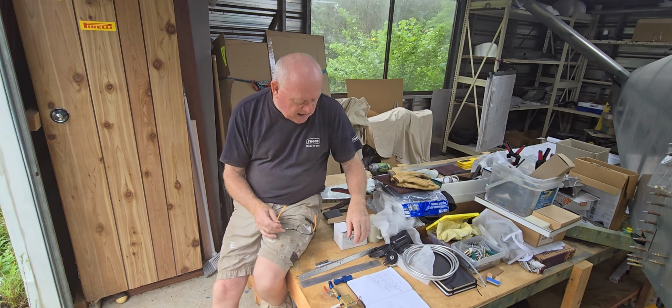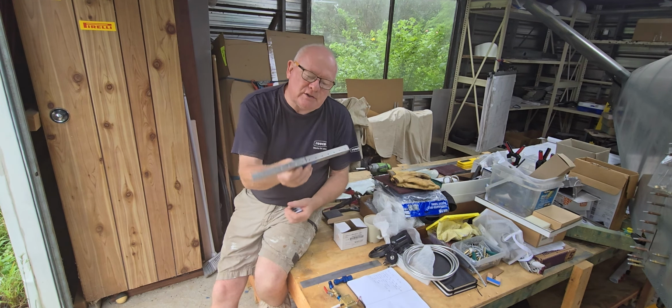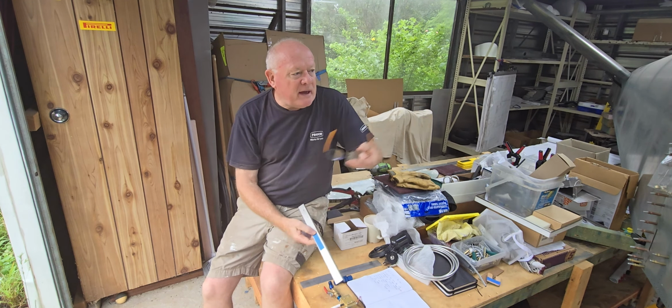So jobs for today are, there's a small grommet to go in the rear of the angle that fits behind the tank, from the tank back to the instrument panel, to stop the tank from sliding back into your lap. There's an angle to go in there, which goes this way, and I'll be putting in a little 3/16 wiring grommet, just to allow the cables to come from the fuel level sender across the top of the tank in through this angle and back into the ECB.